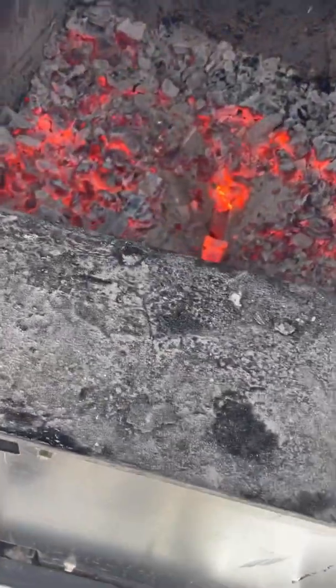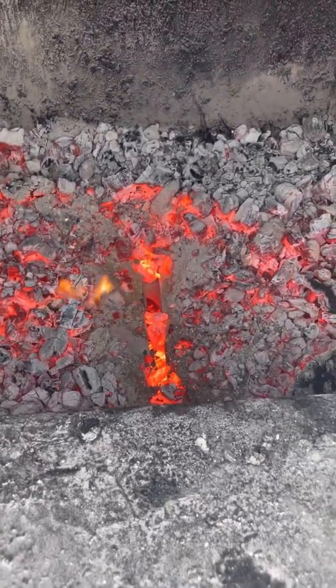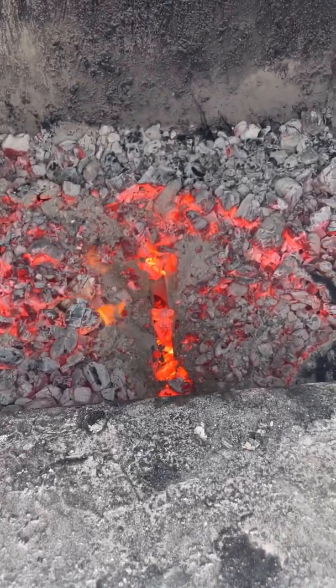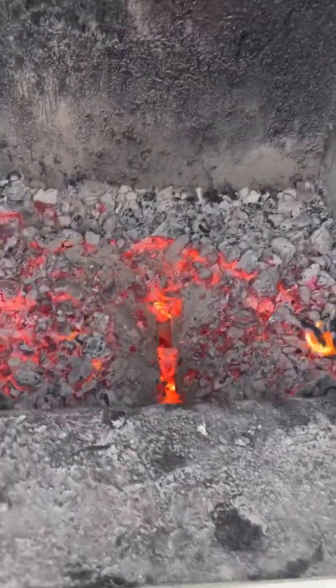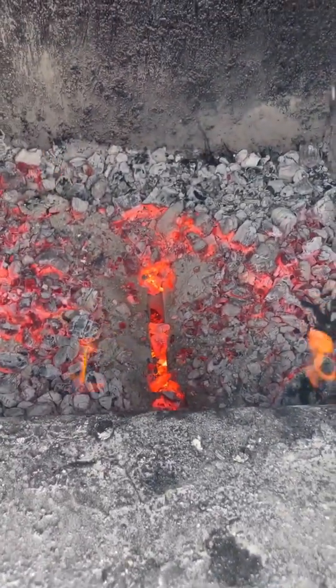You can check your nozzle too while you're at it. I've had clinkers build up over or next to it. I can see I've got enough buildup down in there that I'm going to clean the lower refractory too, but I'll turn the stove off and let it sit a while — make sure it cools off well first.